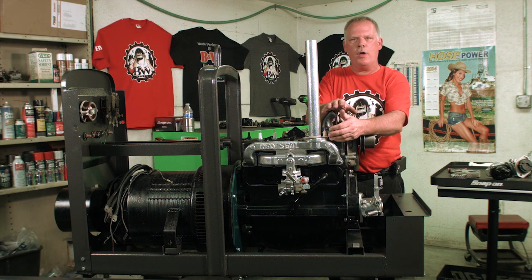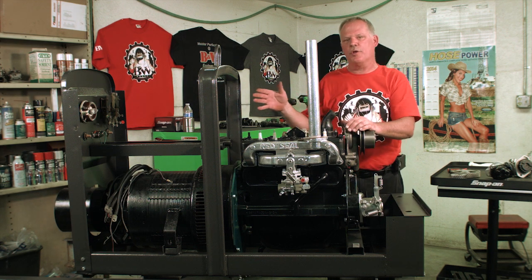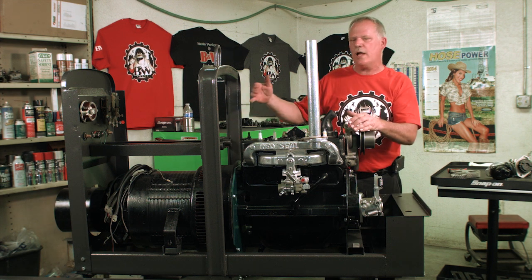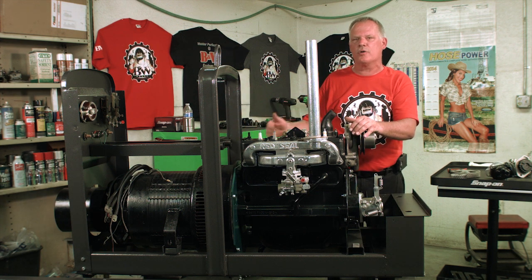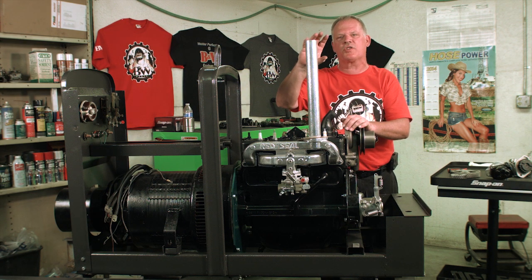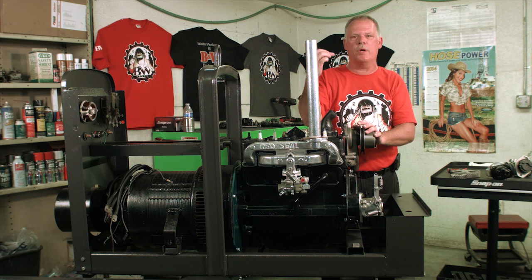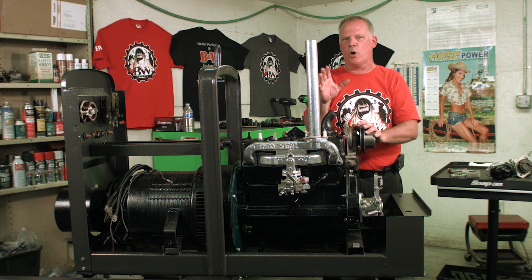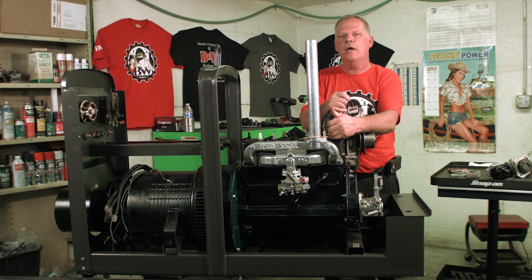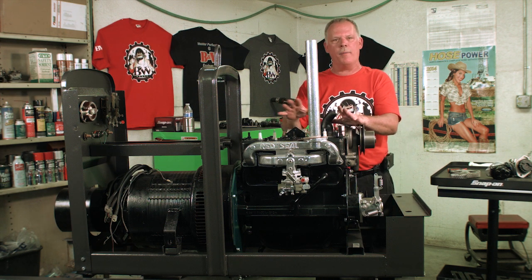Then you're going to bring your RPMs back up to wherever it's supposed to be, so that the RPM is high enough for the exciter voltage to transfer enough electricity to the stator that when you strike an arc, it automatically goes to high idle. You can do that by bringing your rheostat over to 100 and looking at your OCVs. Your OCVs at low idle should be between 30 and 34, somewhere around there. You don't want to leave your RPMs so low that when you strike an arc, it doesn't kick to high RPM.